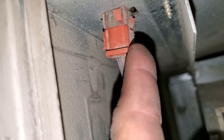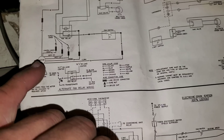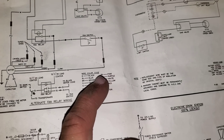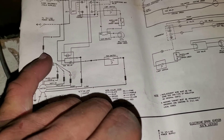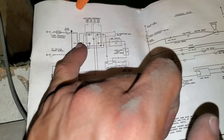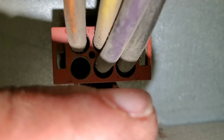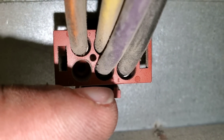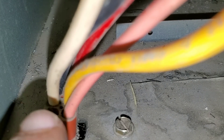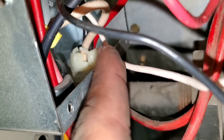This is where all the wires are tied into this harness that come back up and go to whatever controls each one. On our blower motor, we have the purple wire — if you look at our chart, purple is PU. That ties into our harness and comes back up white, which ties into our 120 volts. Here we have our purple — from a bottom view you can see the black in the back and the purple right next to it. So it'll be the middle in the back of the harness. On the top view, you can see the back.